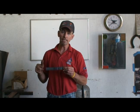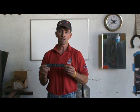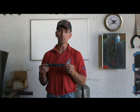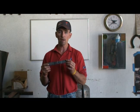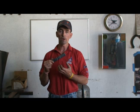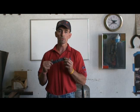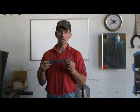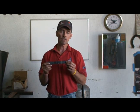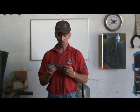It's made out of 9 inches of 1.25 inches by 1/4 inch, which makes it a really deceiving shoe to make because there's a lot of forging. Even though there's not much material, you have to make the sideweight part that has a knockdown in it right where the heel quarter is on the lateral side, and then you put a trailer on there and you draw out the whole medial side.